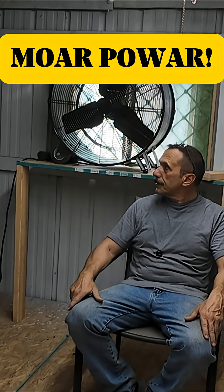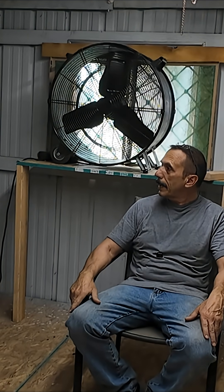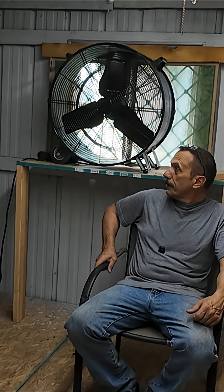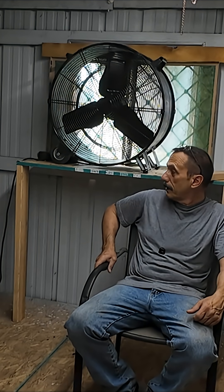With those three rows of miners, I'm going to be at the maximum capacity with the equipment I have here. I've got another 30, 40 kilowatts of solar panels. I have on site the four 11.4 kilowatt high voltage inverters, so three rows is going to take all that up. That's going to be 30 plus — probably need about 40 kilowatts of solar to run those three rows right there.